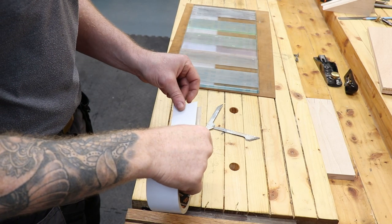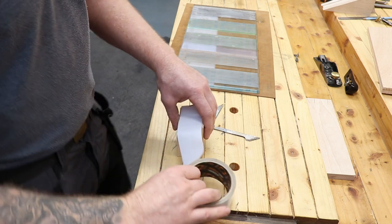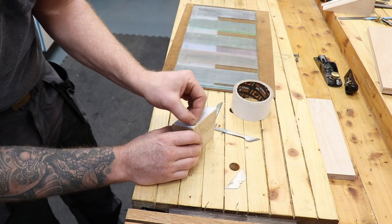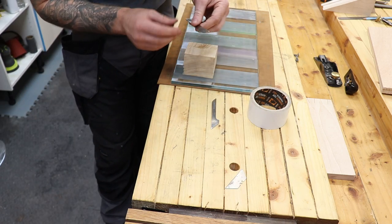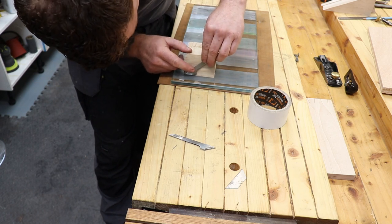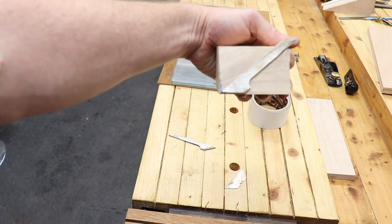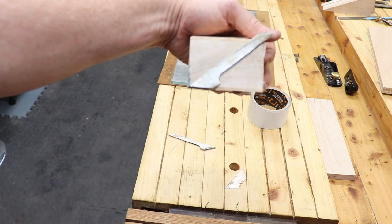Clamping was a little bit difficult because of the angle, so I'm going to use double-sided tape instead — always handy to have in your shop. I'll use a piece of float glass to get this nice and flat. There we go — the knife is stuck to the 20-degree block and nice and square, so let's see if we can grind this.